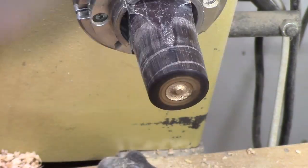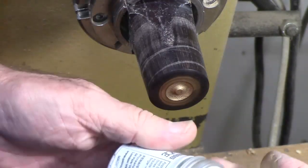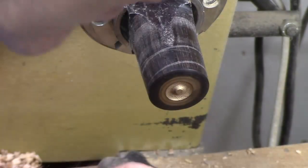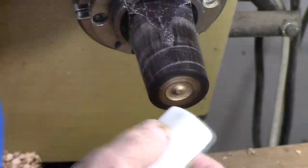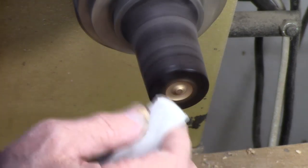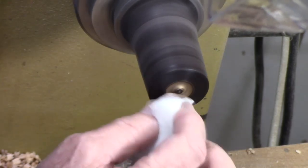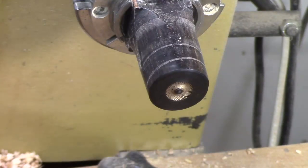It's not working very well, so let's try a different technique. We're going to use a little micro-crystalline wax — Renaissance Wax — it's got some solvent in it that makes a difference. We're going to use what they call a magic eraser. Just get a bit on there — doesn't take much. We're going to turn this up and you can see with those petrochemical volatiles it really cleans it up. I'm going to touch the center — it really cleans it up. I might be able to get some of that surface color out — we'll give it a try.